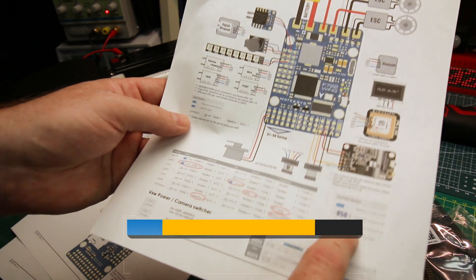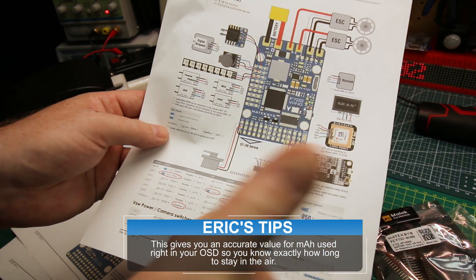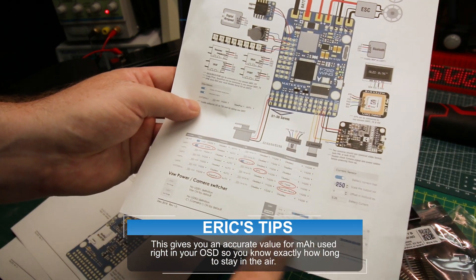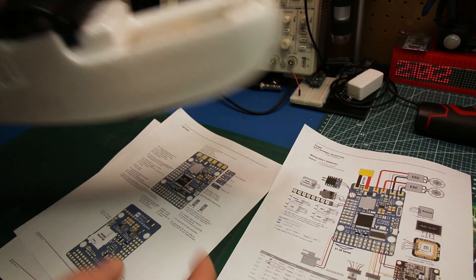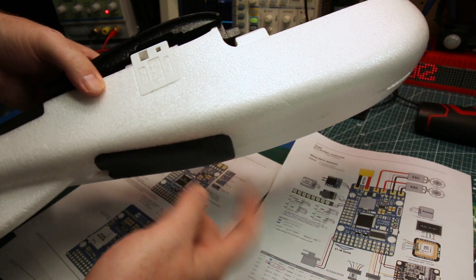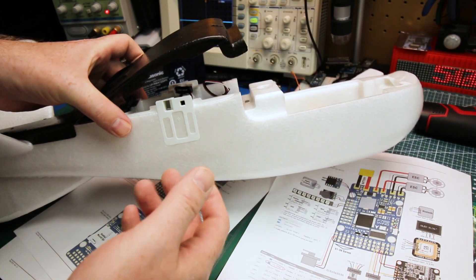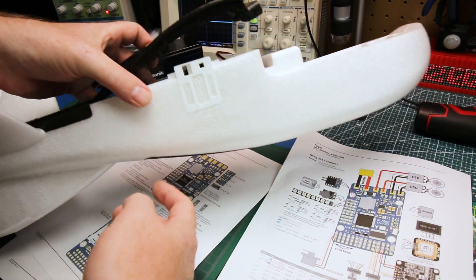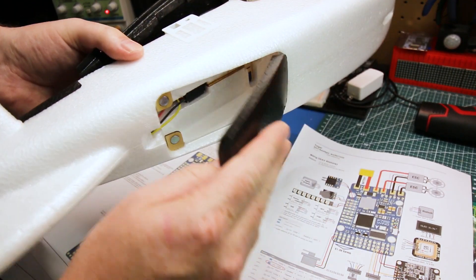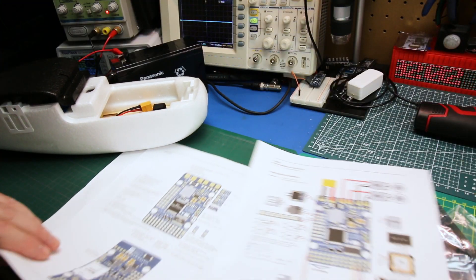Current sensor calibration — tells you how to calibrate your current sensor. Put in 250 there and they say it's going to be bang on. We'll test that. Our camera switcher layout in iNav — we're going to put one camera in the front of this plane and then another camera out the bottom, or at least the leads that I can put wherever I want. I can face it back one day, out the bottom, out the hatch another day if we're doing search and rescue or aerial mapping. Very, very cool.